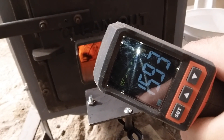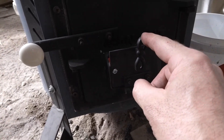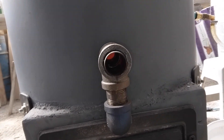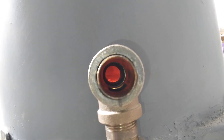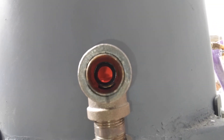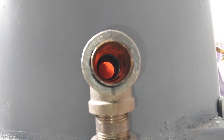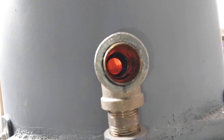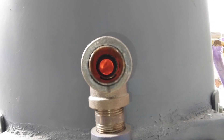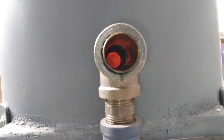This is in Fahrenheit so it's getting way up there in temperature. It's getting a lot of air — I'll bring it back down a little bit. I'm going to pull the secondary air tube out so we can see what's going on. It'll probably take a while to see if this is improving things, but air has got to be coming in because smoke isn't coming out. I do see flames right in that secondary burn chamber, just below the riser — about an inch and three-quarters of space all around the top of the stove where the secondary air tube goes in.